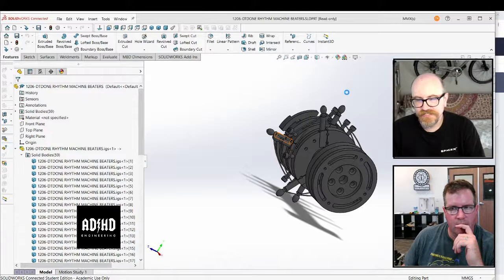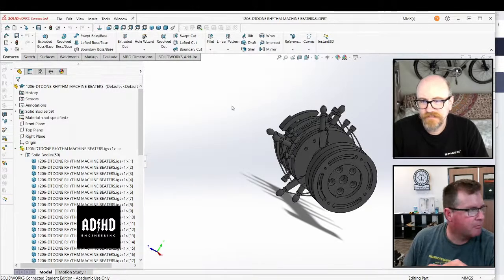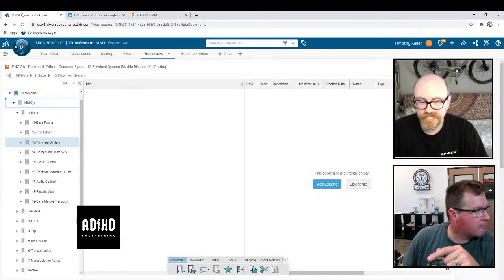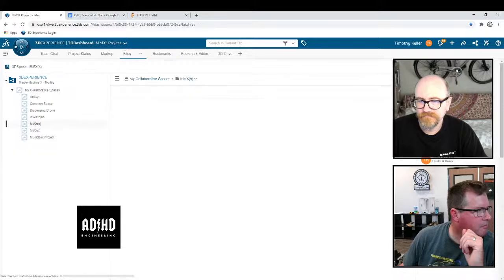You can, but that is a different thing than what I'm talking about. The problem we're talking about here is what if you don't have the computing horsepower on your machine to have Fusion and SolidWorks open at the same time? Right, that's what I'm trying to explain. If you open the IGES in a second instance of SolidWorks, then you don't have to run Fusion at all. If you open the IGES inside of SolidWorks, you could just back engineer with convert entity.